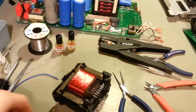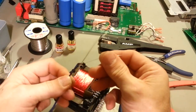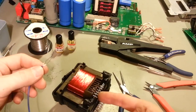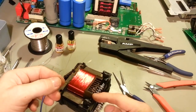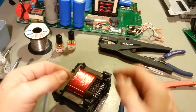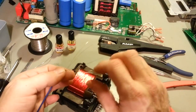Like I say, I just wrapped some little pieces of wire. Just took a normal piece of stranded wire that had tinned wire in it already. You know, strip off a good chunk of insulation, and there's the wires I used. These are the same gauge as these wires. So for ones that had 4 wires, that's what I used. I used 4 wires, twisted them up, soldered them. Ones that had a single wire, 1 wire, and the ones that had 2 wires, I used 2 wires.